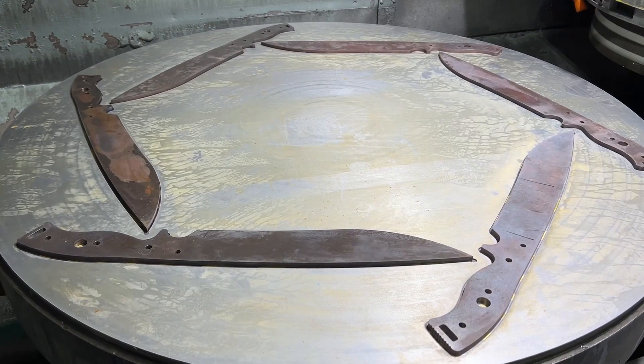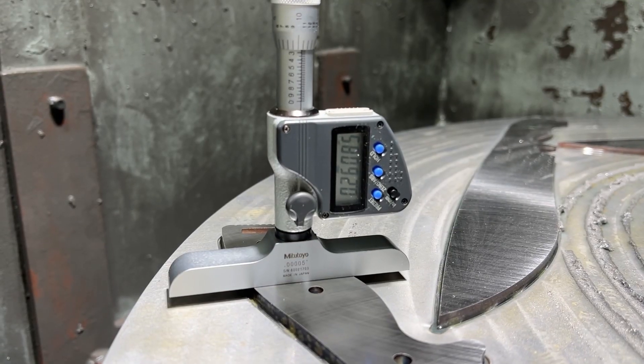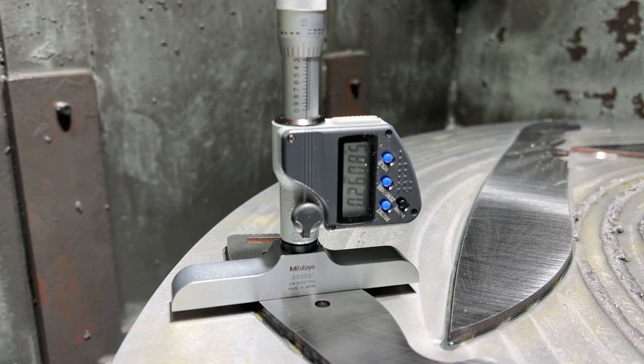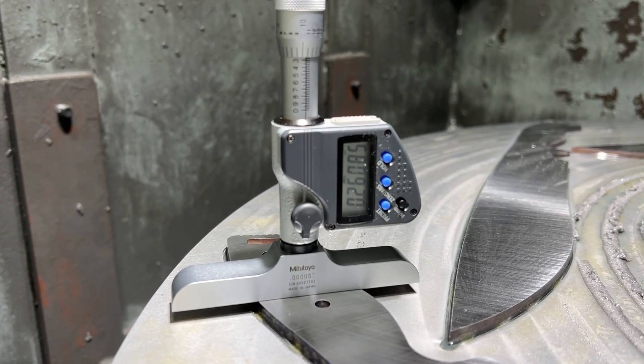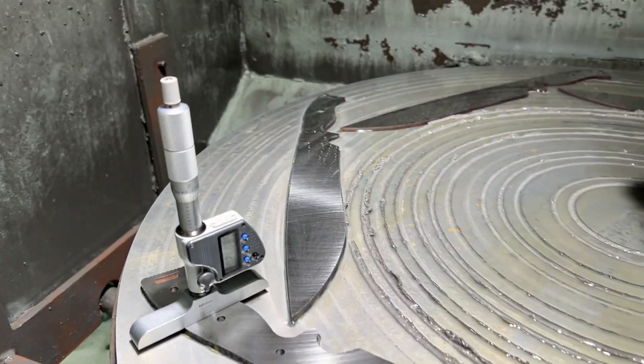We've got the parts and table all wiped off, everything is magnetized and ready to go. We're starting to touch off on side two and you can see all those little highs and lows — that's telling me that the grinding outfit that initially did these was definitely using too much pressure and their table was not properly trammed in. So we didn't have parallel surfaces from side one to side two. One last check before we get these off the table — we are at 260 and eight and a half tenths, so there's plenty of room to clean up both sides with that really fine wheel. These look magnificent.